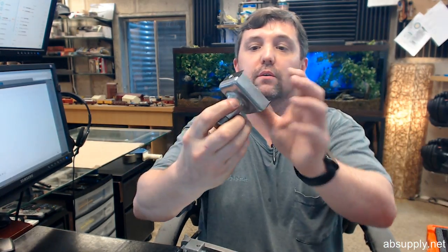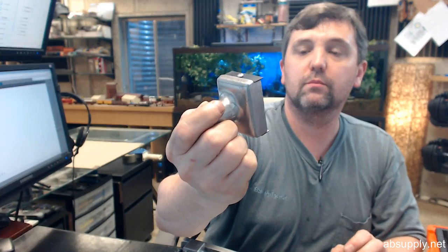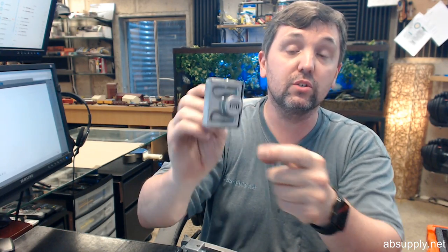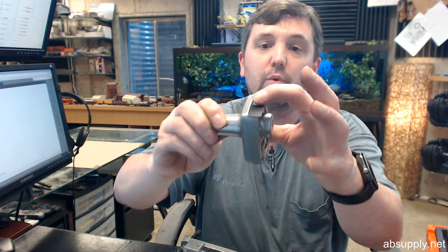You have your full lip strike here that you'll do your prep on. Okay, you're going to drill that 1 inch hole exactly where you need it to go based on how you've marked it, and you take that, give that a couple of wraps, and you're going to do chisel work for the rest. Same scenario, removable cutting edge.